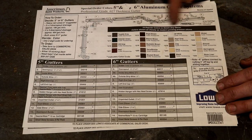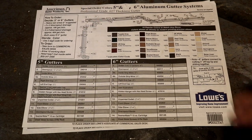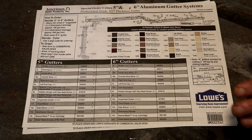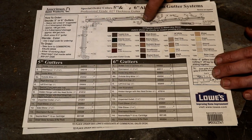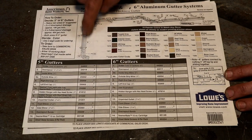They moved the water well, and I had no pooling water in my gutter, so I'm happy with the install. I think a person that uses these really needs to use more hanging brackets than you think you'll need. I think that's the key to having these last a long time, is a well-supported gutter. But so far, so good. I'm happy with it.